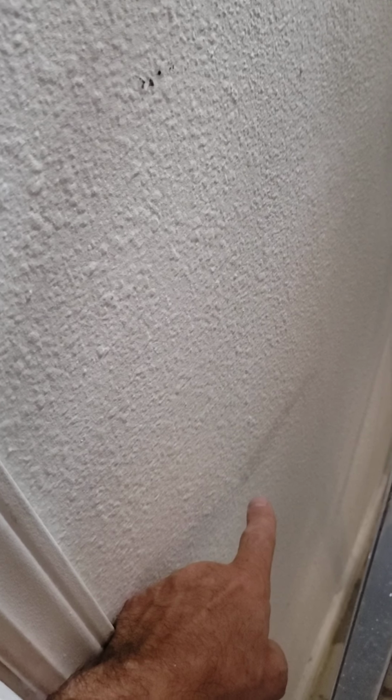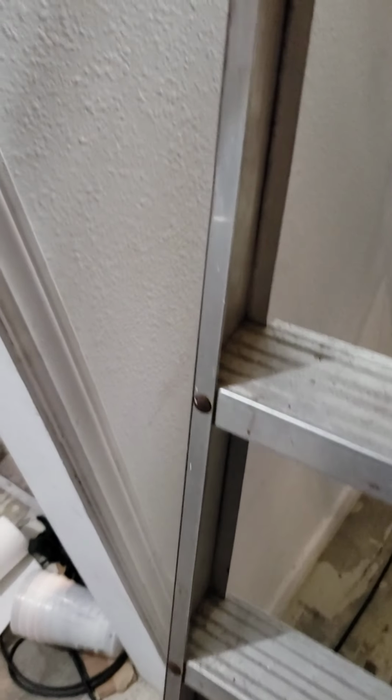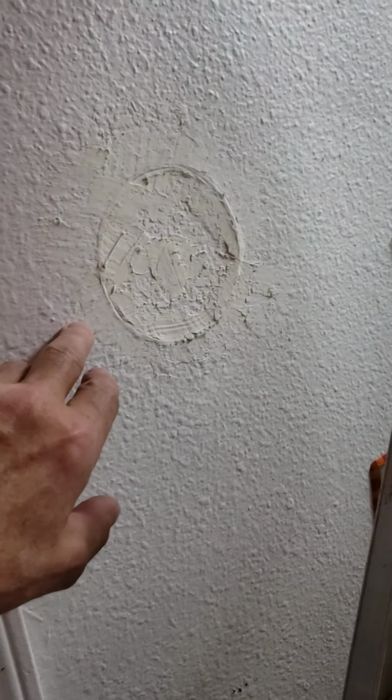You know, I poured a quart. I mixed a quart, combined total between A and B, and poured it in the wall, and it fractured the drywall there, which will get fixed later. So we've been pouring in segments, smaller amounts, in stages. So go about halfway up the wall in each cavity, and I've been doing 16 ounces at a time now. Pour it, let it cure, go in, pour it again.